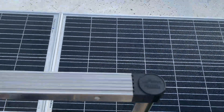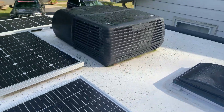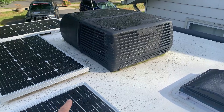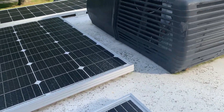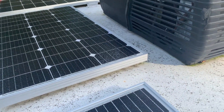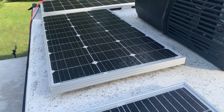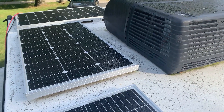That's how I'm going to hook the solar up. I've got 200 watts of power over there and I'm adding 200 watts over here. One more thing — see that air conditioner on the roof? I'm placing the new panels as far away from it as possible, because you can see that panel is shadowed right now — just one of those squares is shadowed — and that panel will not run at all.